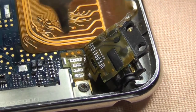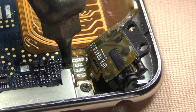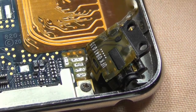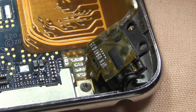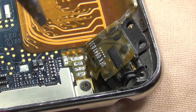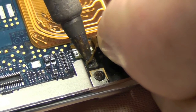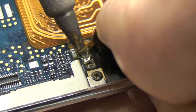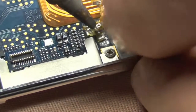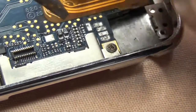There's five connections there on the solder jack. Now the last one — this one's difficult because you've got some tiny resistors and caps on the board there. That's not the end of it; you can't just lift it out. You have to basically just use a solder iron now to just gently ease it away. I'm lucky I have the desolder station, but it does make things a lot easier — because if you're just using a solder iron, you think you've got it detached from the board, but you've formed a bridge between the solder because there's too much solder there. So you can end up lifting pads off the board. The thing here is to be as quick as you possibly can, in and out as fast as you possibly can.